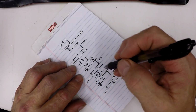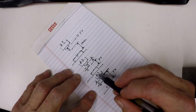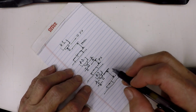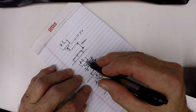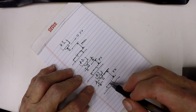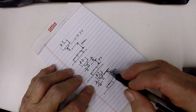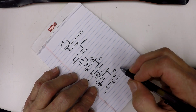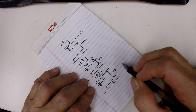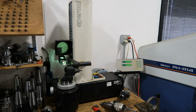All three of these methods work, and I've used all three of these methods, but I prefer the method number 3 for a few reasons. Although it's very similar to this number 2, except that you don't have this reference tool. So you set your fixture offset one time, and then all your tools float with whatever fixture offset you have. And this also allows you to measure the tools off the machine, say if you have a tool setter or something like that.